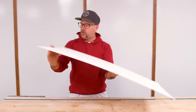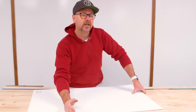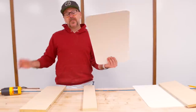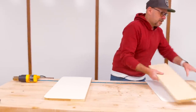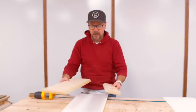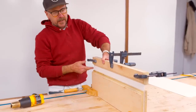For this second method, I've got this sheet of one-eighth inch HDPE plastic — I believe this is the stuff milk jugs are made out of. This can be cut and sanded with woodworking tools. I'm going to make a couple of side panels for the go-kart, so I'll go to the table saw and cut two strips. I'm going to round over the corners and sand the super smooth shiny part. To bend this, we're going to use a heat gun. You need support on both sides, otherwise the plastic will warp. I've got two pieces of plywood cut — one side straight, and the other side with a 45-degree cut so it can bend without interfering with itself. I've got this all clamped up, which gives it lots of support and focuses the bend right at the gap.